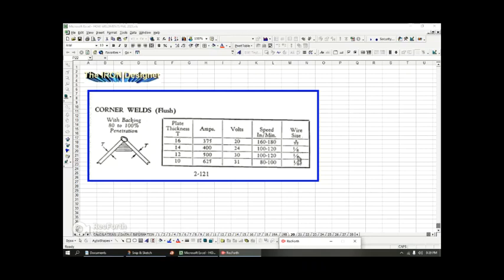And here we go at the wire size, similar to what we normally talk about, but they need such a large wire size, like a 1/8 inch. It's not as large as 7/32, but it's still pretty good size, and it's the size of our welding rods that we use for shielded metal arc for manual welding. We use the 1/8 inch. They're using a wire, we're using an electrode, but they are literally flying across that corner. Just thought you would want to look at this slide.